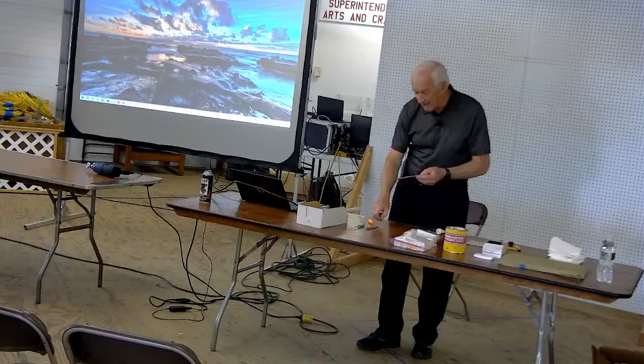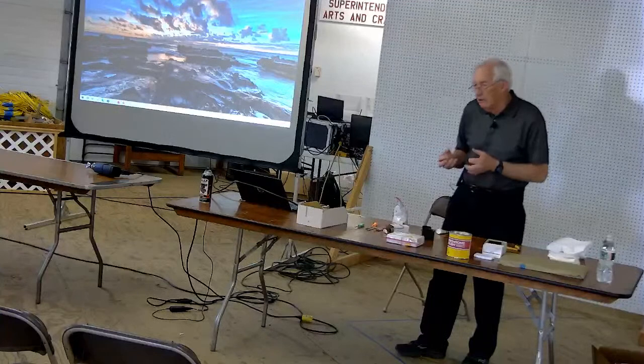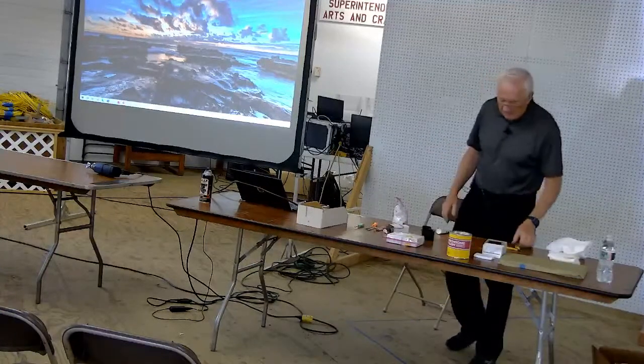One of the other things people encounter, particularly on the Johnson equipment, is refinishing the knobs. This one has been polished with Simichrome and a new pointer installed. Here's an original one to compare. It's very nice but polishing is tedious — if you look at the grooves, you've got to use your fingernail or a screwdriver with a piece of cloth to clean out the polishing compound. After doing 13 or 14 knobs on a Valiant in one sitting, it is tedious.